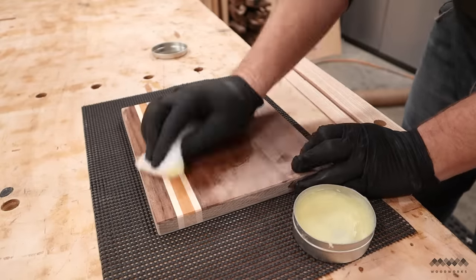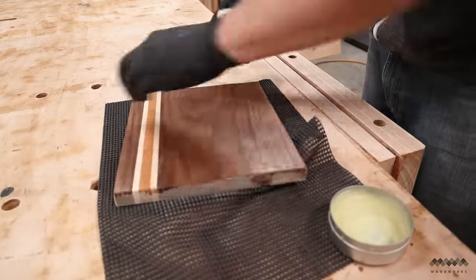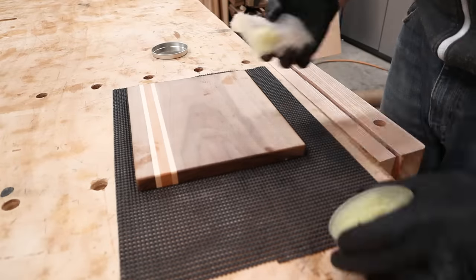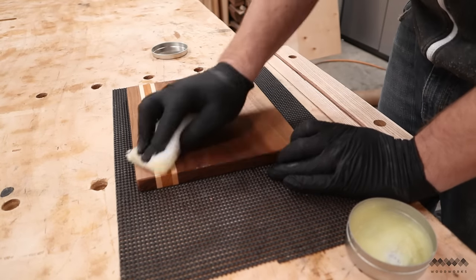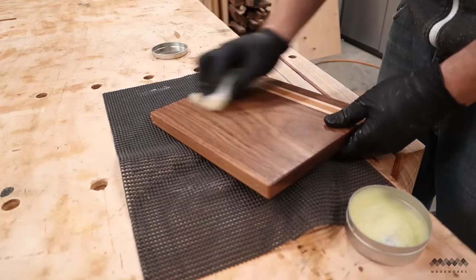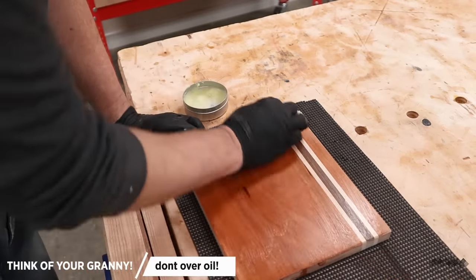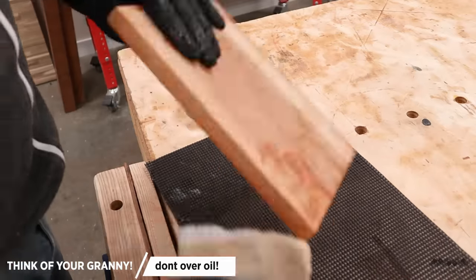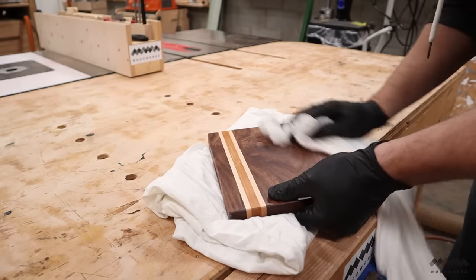The grand finale is to apply the finish. I like using a paste made from mineral oil and beeswax — I make my own and I have a video showing how, linked in the description. I rub a liberal amount of the paste on each board, coating all sides. You may have seen videos where people bathe their boards in a tub of mineral oil — please don't do that, it's totally overkill. Long-grain boards just don't soak up that much oil like end-grain butcher blocks do. Just let the paste sit on the boards for several hours — the wood fibers will take in all the oil they need and leave the wax behind to harden on the surface. Then buff clean with a cotton rag until buttery smooth.